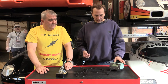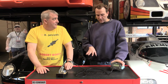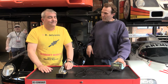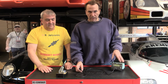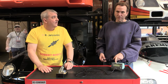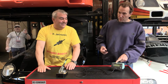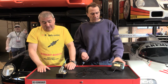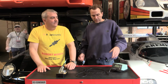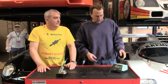But the nice thing about this is that it has a standby mode, so when you forget about it, it turns down. It doesn't turn itself off, so that's my pet peeve. If you like using your iron and you go to sleep, next morning you come in, it's sitting there in standby mode at 350 degrees. But you're okay though, because you got fire extinguishers. I'm okay because I got fire extinguishers. I wish it would just shut itself off. I mean, 12 hours later, it shouldn't still be in standby mode. And I haven't been able to figure out how. I tried to put the standby mode down lower, and it doesn't want to do that.